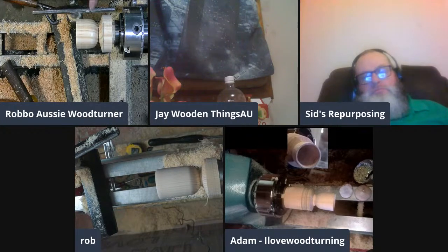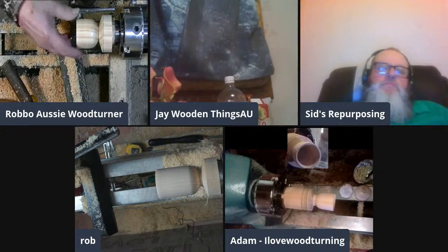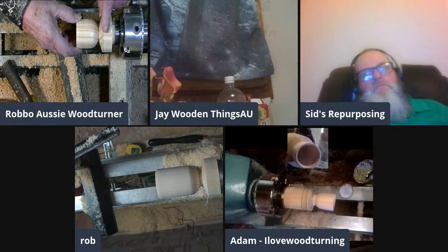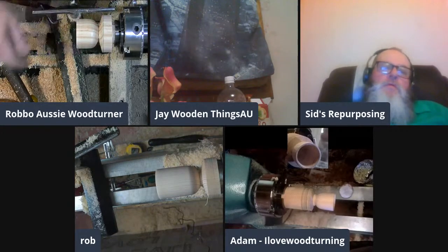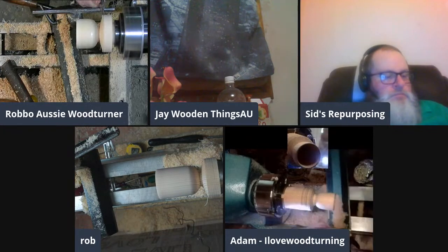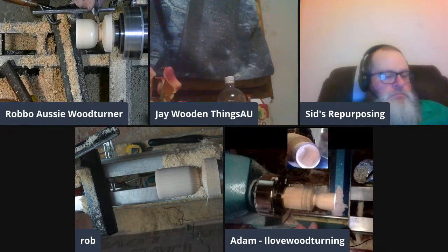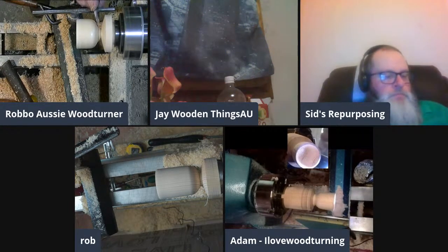Rightio. Now we're going to take this off here. I was going to get you to make a jam chuck with this piece still in here, but we've been going for two and a half hours now. So we'll just take it off with the skew chisel, all right? So make the cuts deeper down here. Suppose you've got the leaf. Using a long point, follow the curve around.